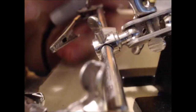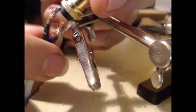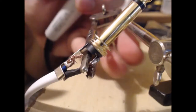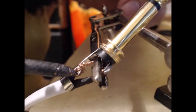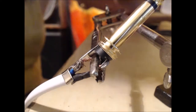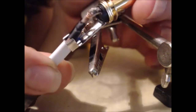That side should be done. We flip it over and solder the other one — just doing the same thing on this spot. Heat it up, touch the solder, and there you go. The longer you hold it the more the solder begins to flow down and cover that joint well. And there we go — wires are attached.